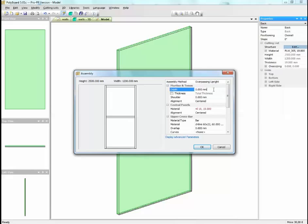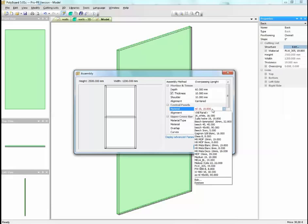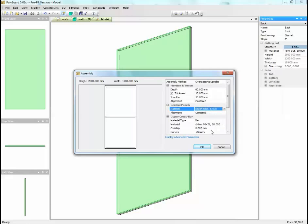And let's give it a tenon which is 6 centimeters long, and 10mm wide, thick, and let's give it a shoulder. The terminology here is not exactly right; the shoulder is in fact the offcut, the setback of the tenon. And let's give this the panels. Let's put a paneling in it, and I'll choose from my materials. Here I think I do have a beech 5mm panel. And now we're going to give some materials for the stiles and the rails.